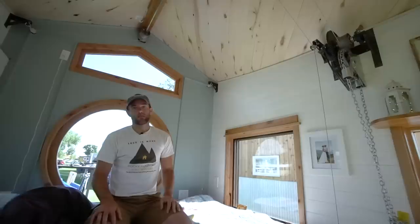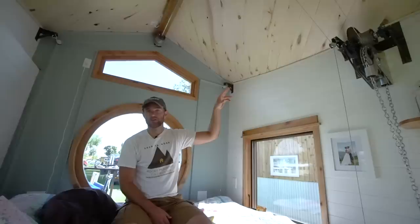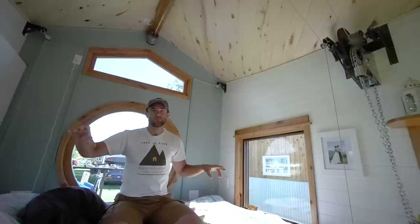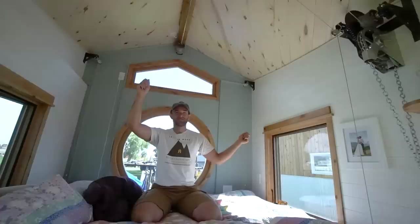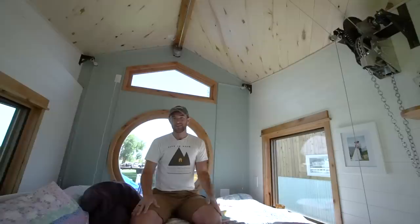We had to do the same thing for the roof decking — you can't just use a flat sheet of plywood. We had to rip it into 8-inch strips and put it at a 45, then trim all the ends off. So it's a lot of cutting, a lot of time. Sometimes it's really hard to just pull a tape on those measurements — you sort of have to get it close and see if it fits, then cut. It was painstaking, but the result is just mind-blowing. We've done this on one other house before, so it was kind of a no-brainer to use it again.